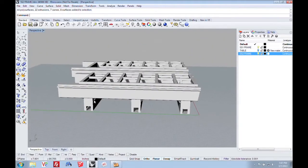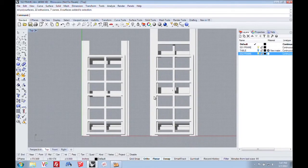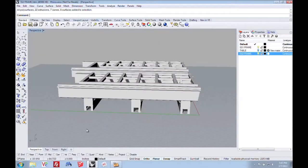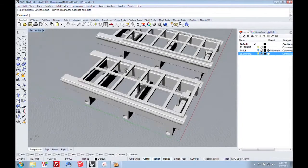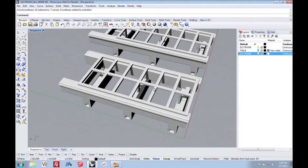If you look at them, they're very similar. From a top view, from the front to the back of the table, the structures are very, very similar. The reason the Smart Shop two is a little different is because this machine frame has a tool changer, therefore it has to be longer and there has to be a bar that the tool changer rack mounts on. But the rest of the design is the same. So we get exactly the same edge finishes now on the Smart Shop one as we do on the Smart Shop two.